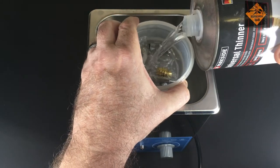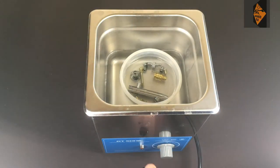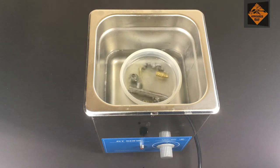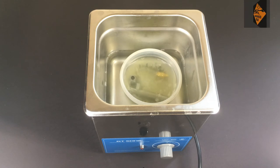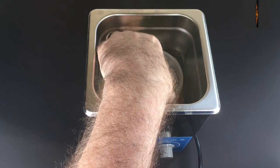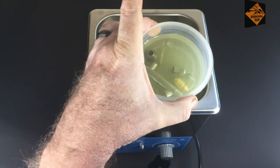I'll let this run in a speeded up clip to let you watch the colour of the thinners change. And yes, I know, enamel thinners rots the rubber seals. All mine have been previously removed and exchanged for beeswax. Look at the state of that thinners, and that's just a month's worth.